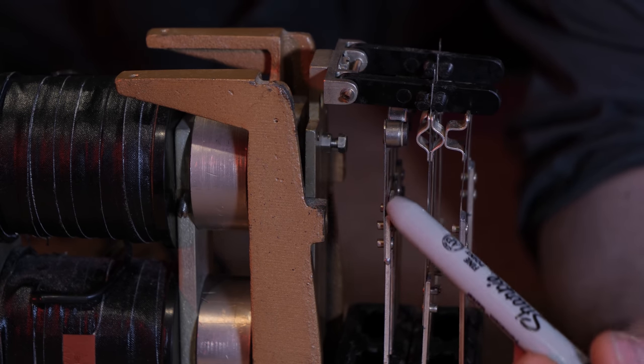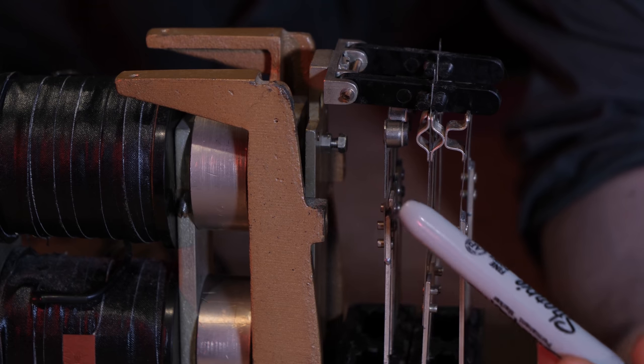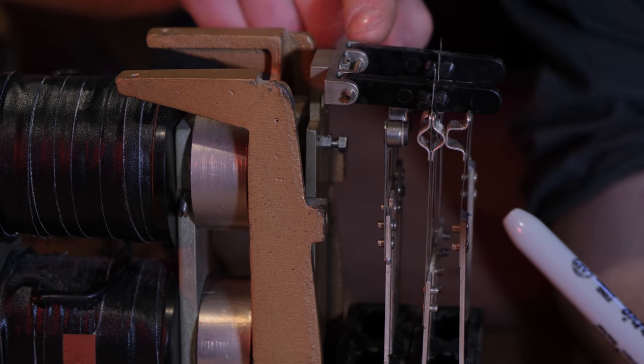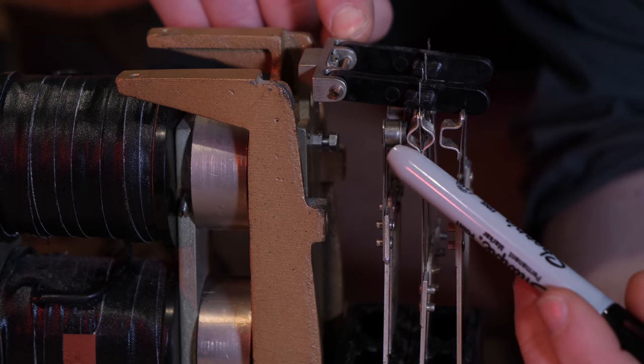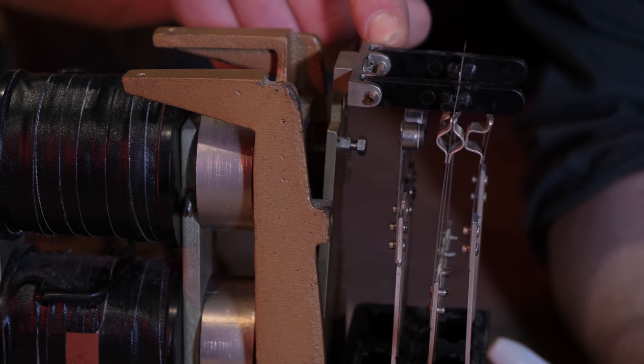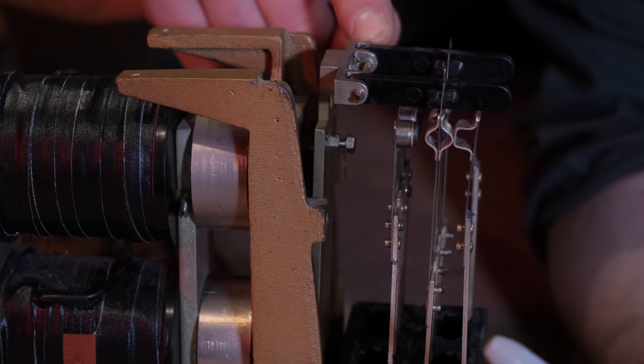And then there's the other bit here, and this is called the normally open contact. That's because it's normally open until you send electric charge through the electromagnet, and then it will close and it will make the contact between these two contacts. So you've got two poles to the switch. You've got the normally open and the normally closed. And these come in handy in various different arrays.